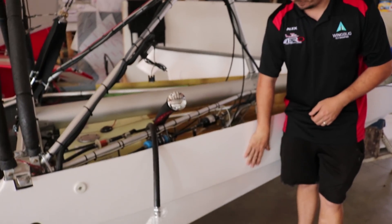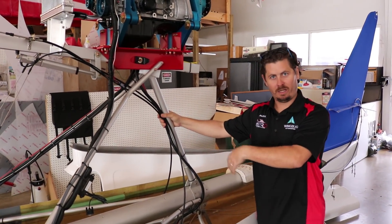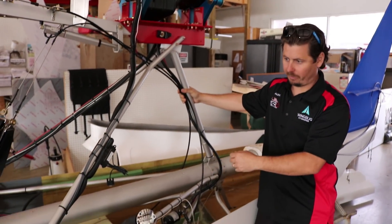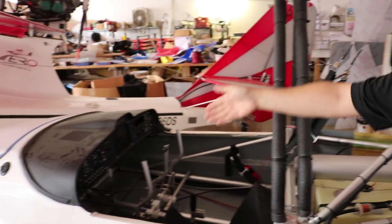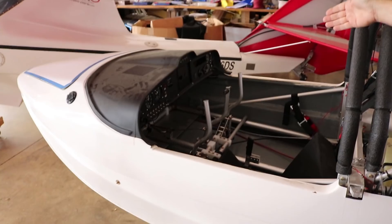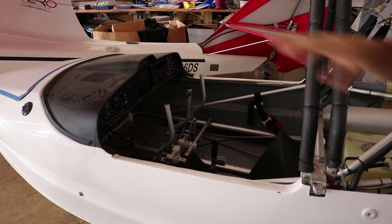So if you want to land on water, you will need the hull. So there are three sections to the hull? There are. You have your lower section, which is the hull itself — what lands on water and provides buoyancy. Then you have what's called a turtle deck, which comes over and covers the whole aft section. It's both aesthetically appealing as well as semi-aerodynamic. And then you have the nose, which is your panel itself — where you would install all your gauges and whatever layout you chose — with a nose hatch incorporated there to cover up the front portion.